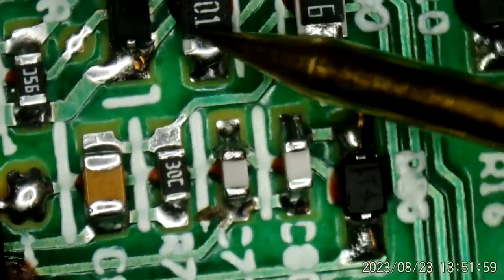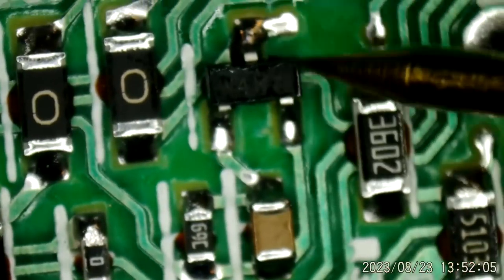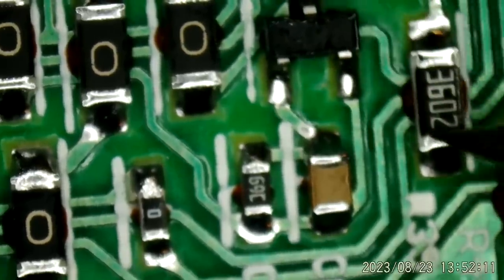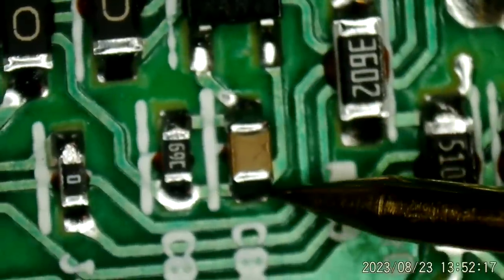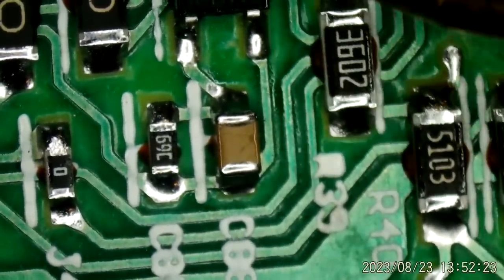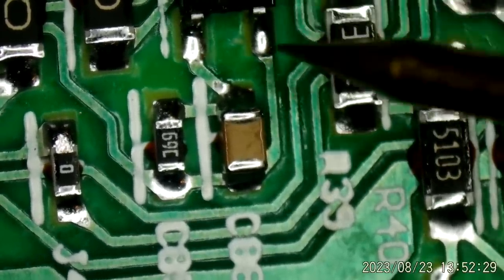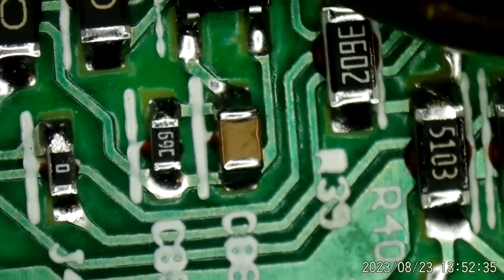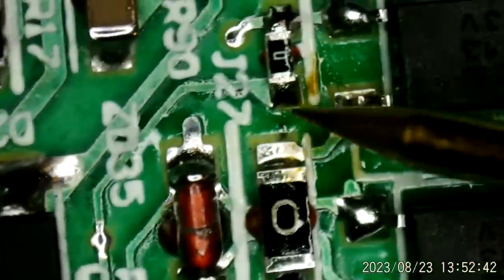And that's why this goes over here to this 0-ohm jumper across there to this MOSFET. So when this MOSFET is turned on, this other side is ground, I believe, right down here. You short that feedback voltage going into that IC to ground. And if it loses that feedback, it shuts down immediately. It just shuts down. And so what does this connect to? Right over. What turns on that MOSFET is this opto-isolator right here.